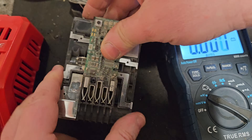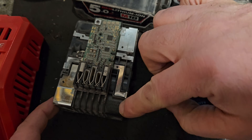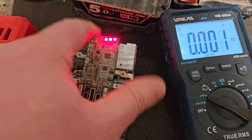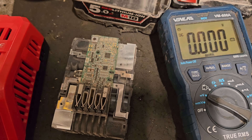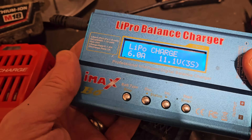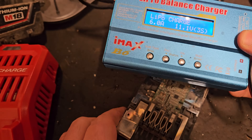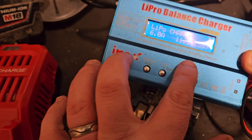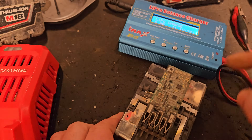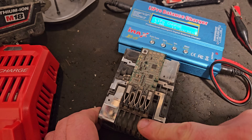It takes a bit of time, but we can charge these three banks of cells together — bring them up to four — and then charge this one on its own and bring it up to four as well. It takes a wee bit of time but we should be able to restore that pack to its former glory, give it four bars and get it sorted out. Here we have the Junsi IMAX B6 balance charger. I use these to charge individual banks of cells. I can charge the three together, which is the 3S configuration — these three banks — and then charge this one on its own.